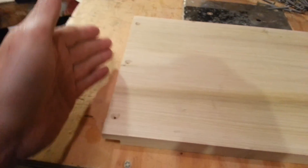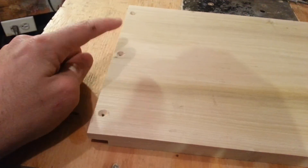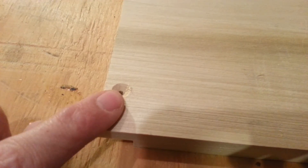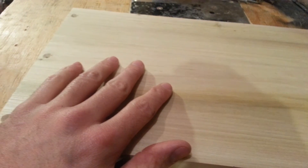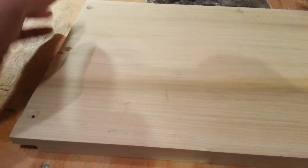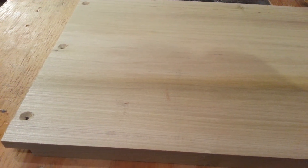What I'll do with my boards is go down each side and measure down about an inch, out about an inch, and in the center, then shoot that over three-eighths from the edge — pre-drill them and countersink them. Three-eighths puts you right in the middle of the rabbet, so you're right in the middle of your other board. The main reason I do this is to make them look nice because people buy them. But they don't have to be exact — you can eyeball it, throw in three or four eight-penny nails and it'll hold just as well.